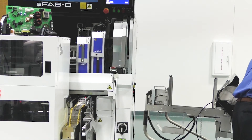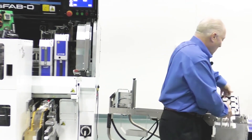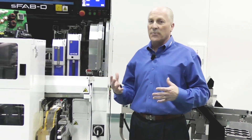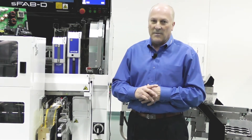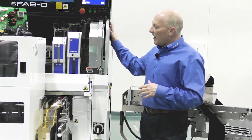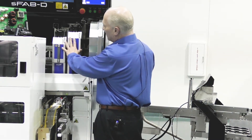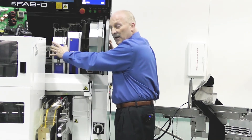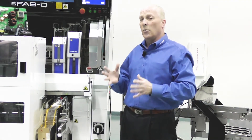Along with the placement heads, we also offer quick changing tool stations, just like our SMT platform — everything is reconfigurable. Where we take modularity with the SmartFab system, many applications use robotic cells with wire cages that take up a large footprint — an 8x10 or 12x12 operation area with a collaborative or arm robot. By deploying into an S-FAB system, you shrink your factory floor space occupation and increase throughput with two placement head systems. You can also incorporate a process assembly head on the left head for soldering, screw gun, or dispensing operations.